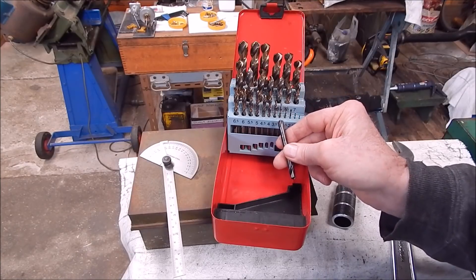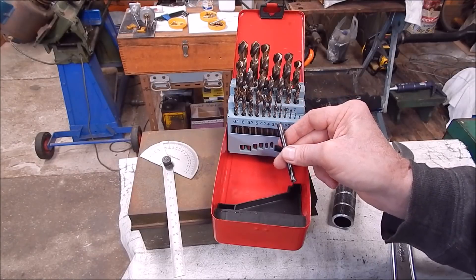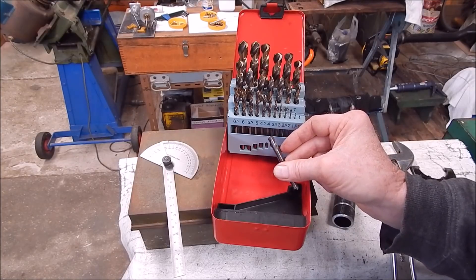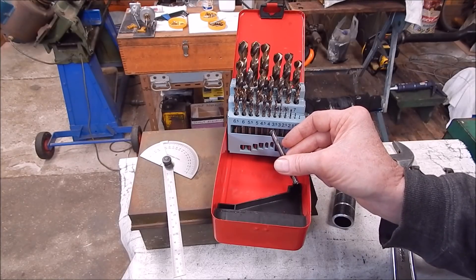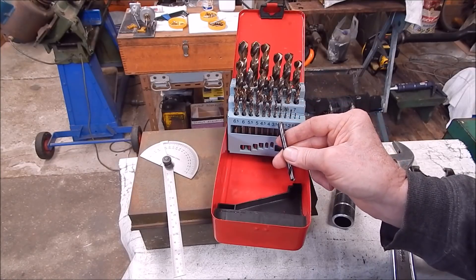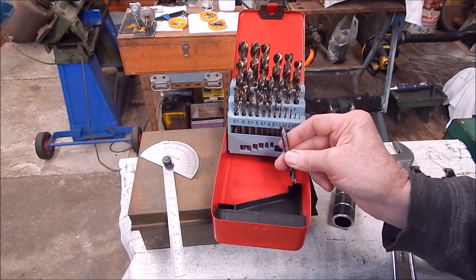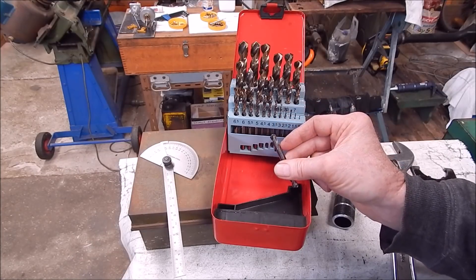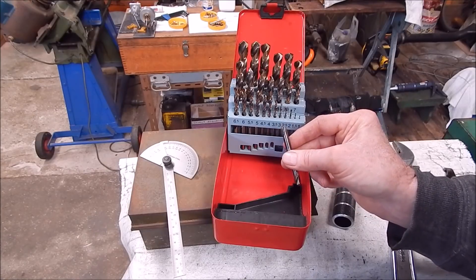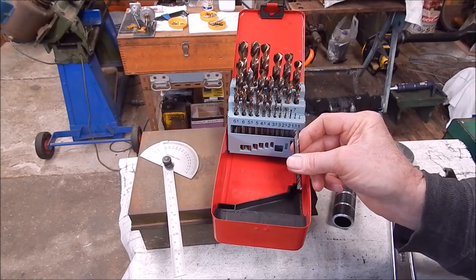Now that's really wrong. I mean, obviously it's a lot better than using a center drill, which is totally wrong — a bad habit a lot of people would do. Yeah, I'm guilty of that. Quite often you'll get by with it, but you've got a good chance of breaking the tip off the center drill, which invariably happens. So anyway, I thought I really should get some 130 degree spot drills.